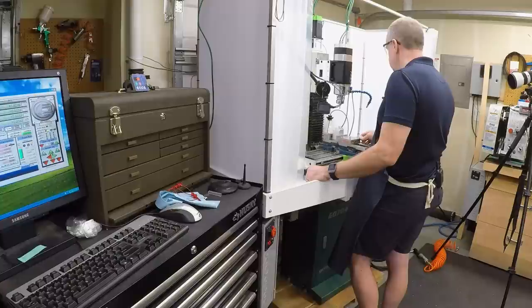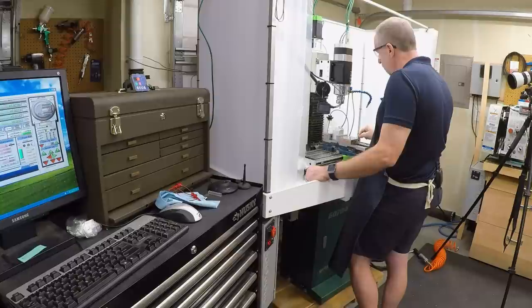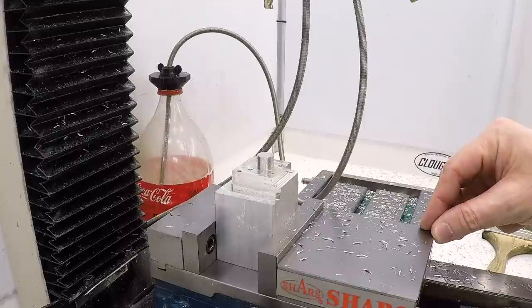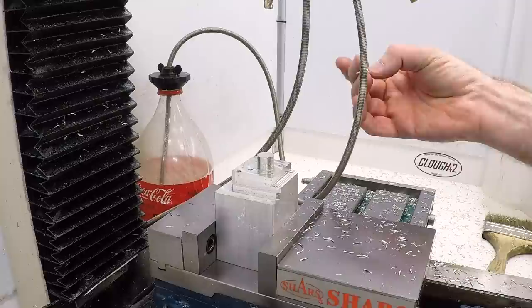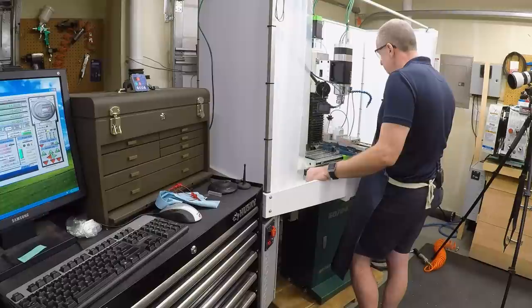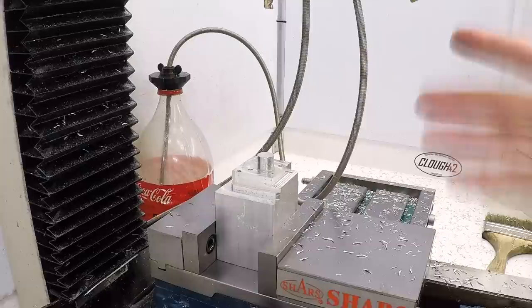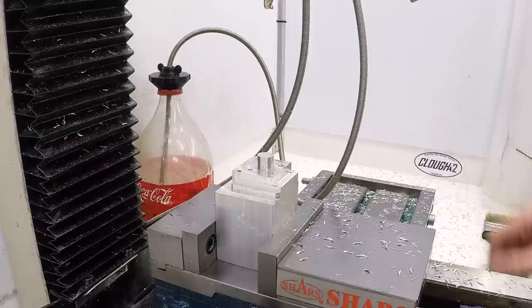Now I just need to go find something to actually make with it. I've got several projects in mind: I need to make a bracket to mount the VFD controls, and at some point I've got to go back and do a proper encoder mount for the electronic lead screw on the lathe. But for now I'm very pleased with this. It's taking very nice chips — two thou per tooth, plowing through at 72 inches a minute. This is just going to be a game changer for this machine. Instead of taking an hour to mill a part, it's going to take minutes. I am looking forward to that. Those videos will be coming. If you enjoyed this video, give me a thumbs up, feel free to subscribe to the channel, and leave me a comment. I'd like to know what you think. Thank you for watching.